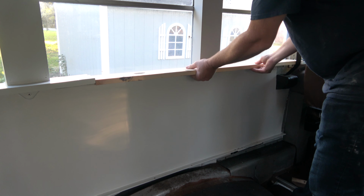A notch is required at the top to allow it to fit snugly into the windowsill. Measure the dimensions so we can cut a new one. In this video, we're only going to make a single one of these units, but once you know it's the correct dimensions, the most efficient thing is to make the cuts for all of them at once, like a miniature production line.